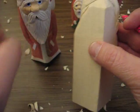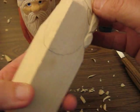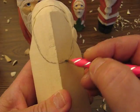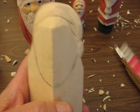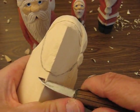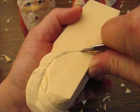Now we're ready to put the beard in — however long we'll make it. This one's fairly long; we won't make it as long, we'll just make it down to here. What we want to do is try to match that up. Let's go up a little higher with this — it's not rounded enough. We'll take that bottom line off. What we're going to do is make a stop cut down here, undercut it, do another one, and use your thumb for that. Another stop cut on that line, so we're going to follow this line around to the bottom, exactly like that, going from the bottom to the top.